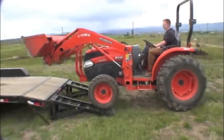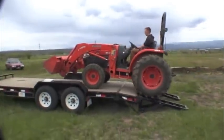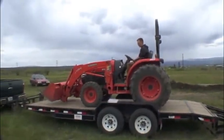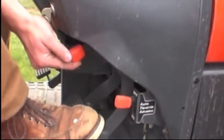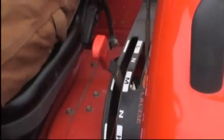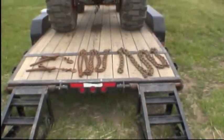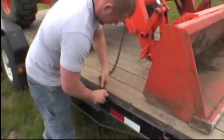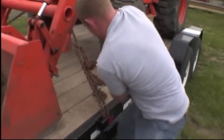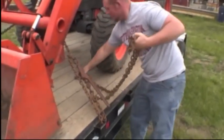It is important that 60% of the weight of the equipment is in front of the front axle. This ensures proper tongue weight and smooth handling while transporting your load. Set the parking brake on your equipment and also place the equipment in gear. For equipment weighing less than 10,000 pounds, two tie-downs are required — one in the front and one in the back. Make sure the tie-downs are tight and secure the loose ends so they do not flop around on the trailer.